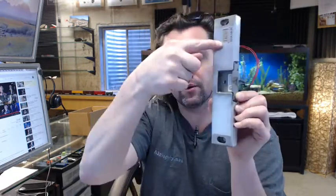It has a solenoid up here and down here because you have these two triggers that basically release. This can be field selectable for either fail secure or fail safe. Fail secure means when the power is out, the strike is locked — that's secure. Fail safe means when the power is out, the strike is unlocked.